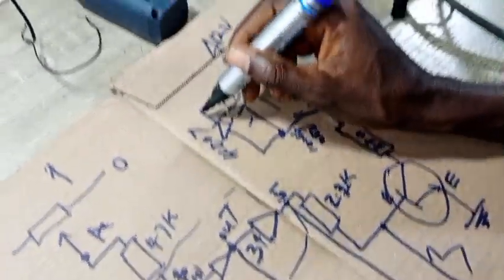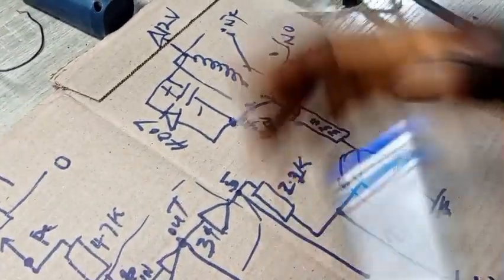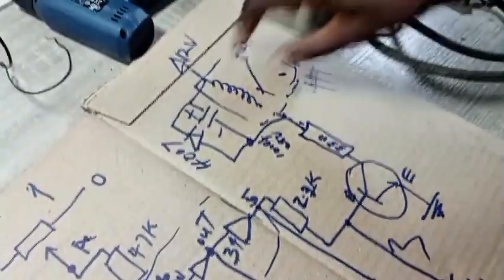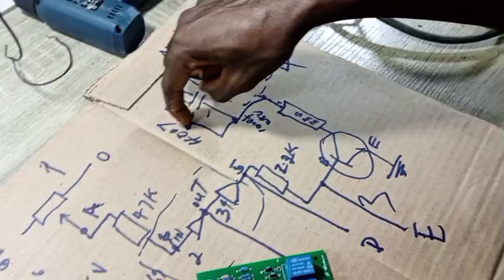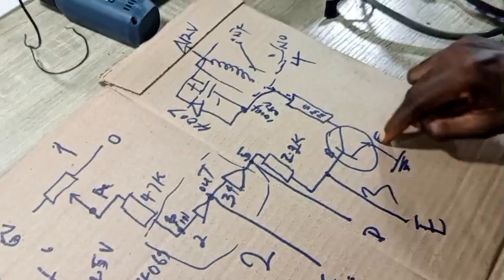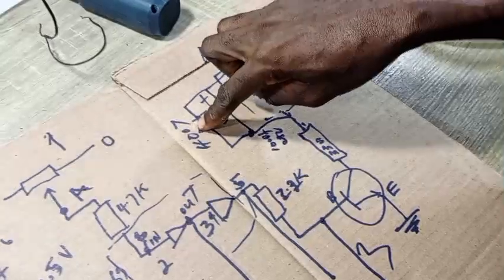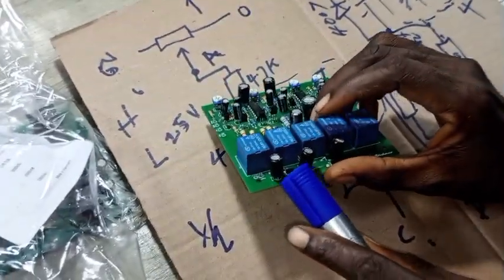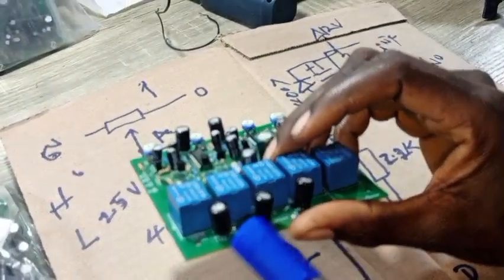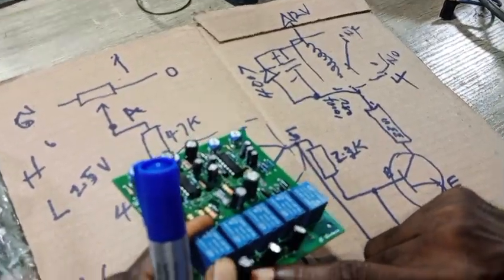But at times, this diode might short-circuit the board. That's why I advise people: you can desolder this relay to see whether there's a short circuit. If you desolder it and here is reading continuity, you know that something is wrong with this diode — change it before fixing the relay back. Because at times you find the whole of this place looks okay, but yet the relay is not triggering. Remove it. Check this diode — which is all these diodes at the bottom. If it's not reading well, remove it and change it. Or at times the capacitor might be bridged — change it.